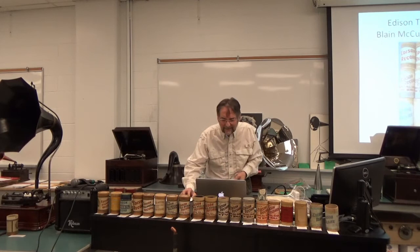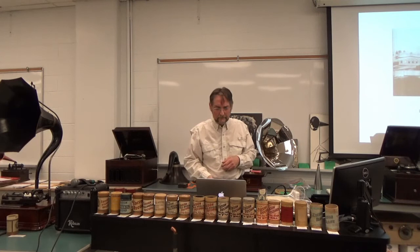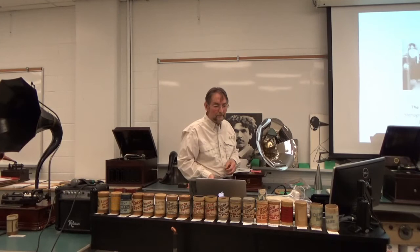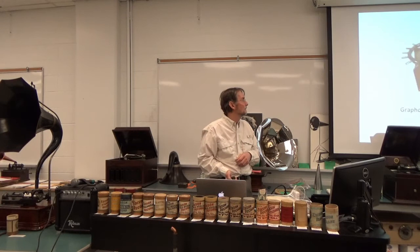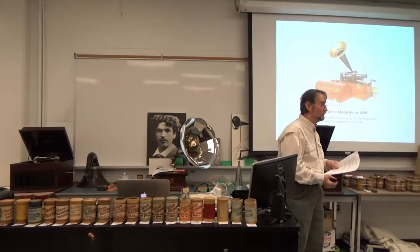Do you find you get a better recording with a metal recording horn? The commercially made ones back in the day were fiber board. I like your recording better. Well, a lot depends on the recording head. I've got about 10 of them, and they're all different. Some record really loud, but the high frequency isn't there. This one's good because you could recognize those voices, and it's good for recording music or singers. But some of them are very bass heavy, and the treble isn't there. So you just have to try a lot of them.